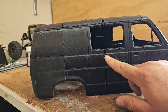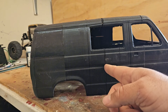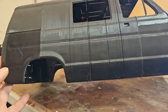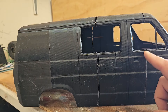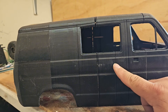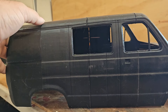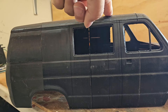This seam right here and this seam right here — they don't show up in Cura or even Tinkercad — but it doesn't print right. It's like perforated almost. I went through a whole spool of filament trying to get this print right and it didn't mess up until right here, like 20 hours in. This piece right here would just mess up the whole rest of it.